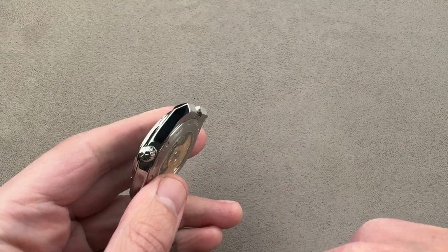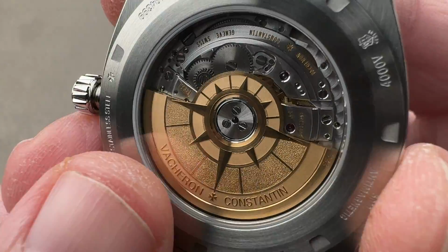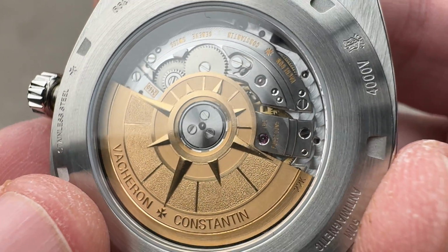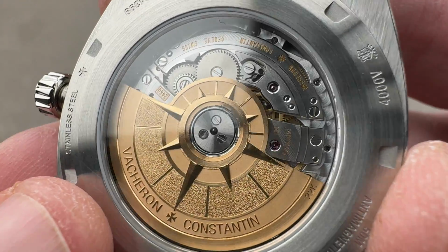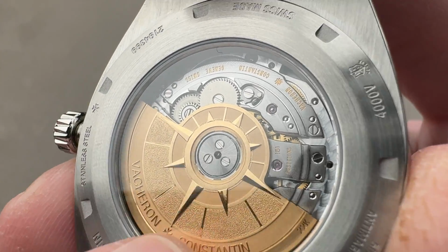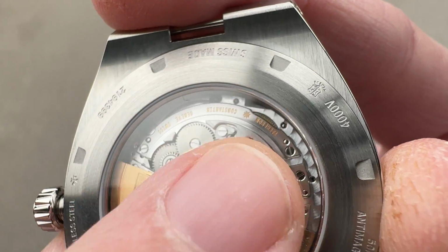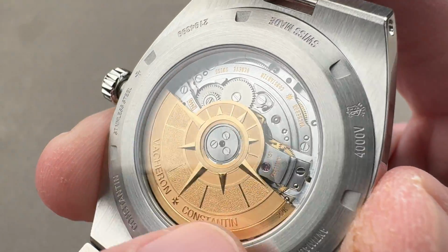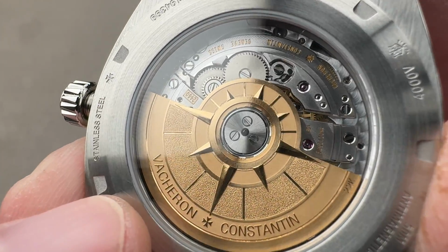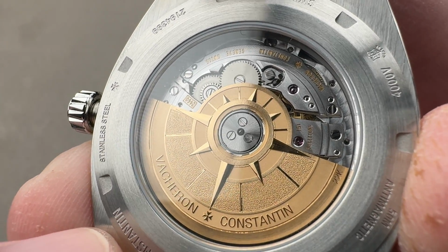We'll pop the bracelet off so you can more easily appreciate this movement. Note the rotor, which is 22 karat, not 21 karat, not 18. By using a dense gold, it creates a more efficient winding system. You can also see ceramic ball bearings for greater efficiency and lower maintenance requirements. All screw heads are black polished with chamfered slots in circumference. You can see the little locating pegs to place the bridges on the base plate. They have been polished on their top. There's engine turning perlage across the base plate, perfectly aligned stripes across the bridges. We have satination on the wheels, and the rotor features a compass rose motif. It includes chiseling, polishing, beveling, satination, and snailing. Quadruple finished rotor, quite attractive here.